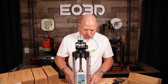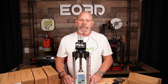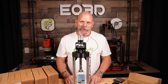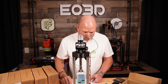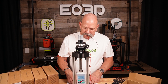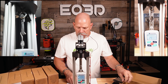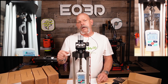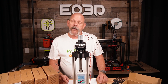PA12 carbon fiber — another roll that was wet; I forgot to put it back in its box after taking it out of the dry box from a review several weeks back. Wet PA12 carbon fiber printed at 290° with a 50° bed: vertical breaking point was 14.17 kilograms, and the horizontal print was 31.51 kilograms. When I put it in the dry box, it was measuring 46% relative humidity — so definitely wet.